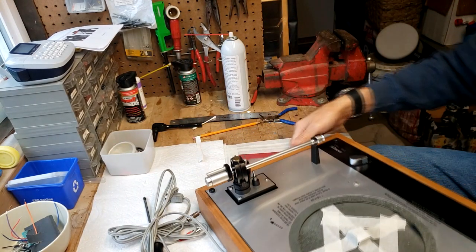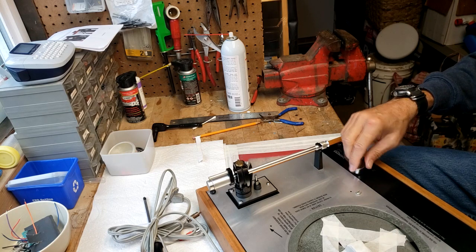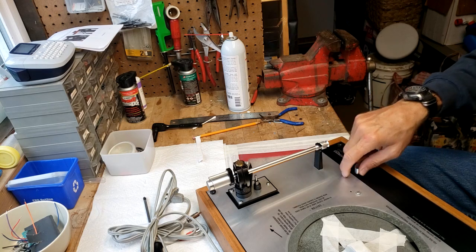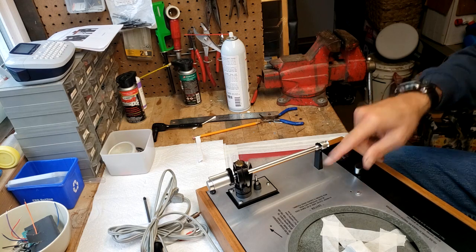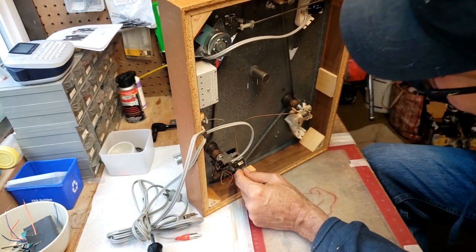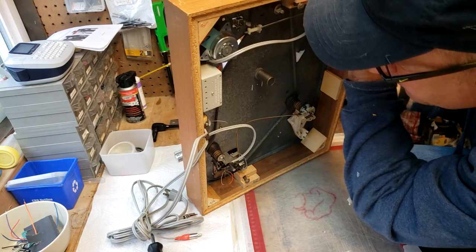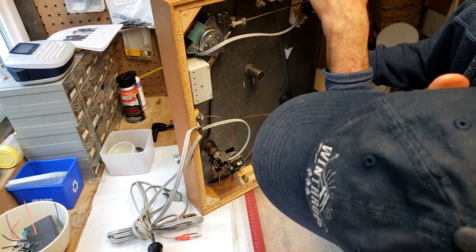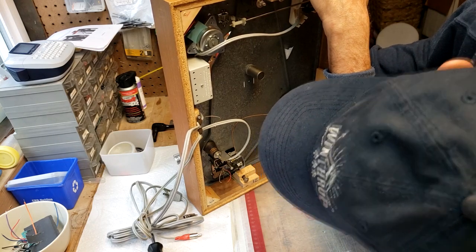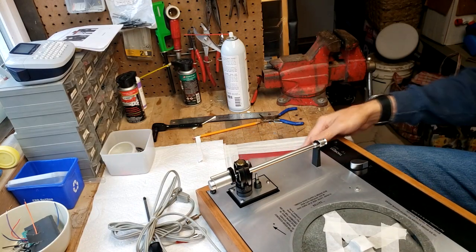And now the cable is in this receiver here, which is what lifts and lowers the, allows the tone arm lifter to lower. And you can see it perceptibly moving. That's all you need. It doesn't move very much. And then of course the weight drops it down. So perfect. Here's how your lever works. So that's done.